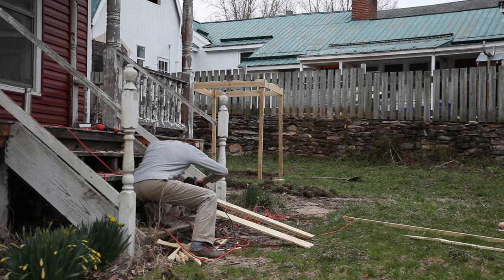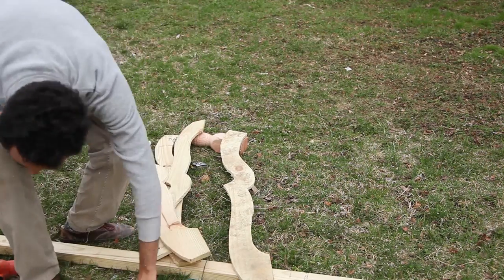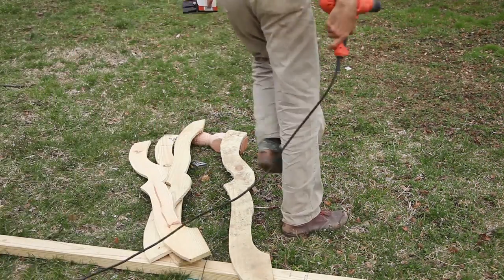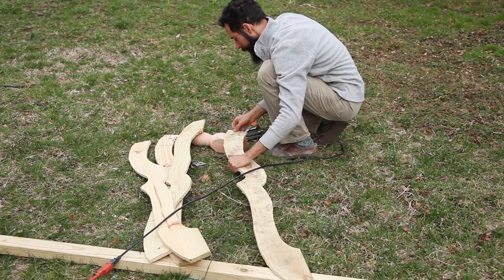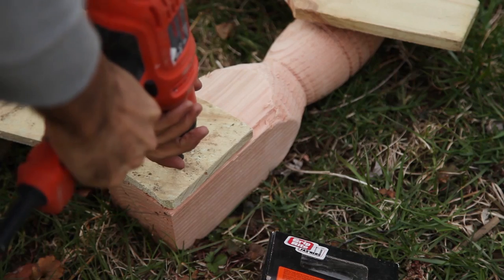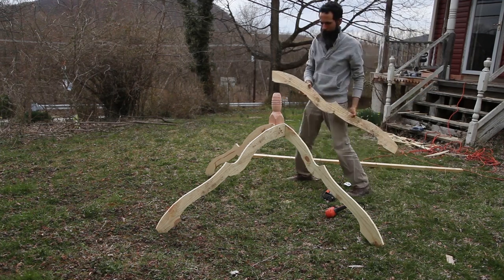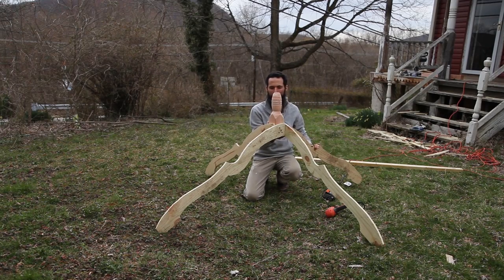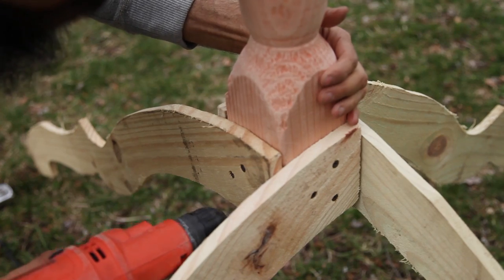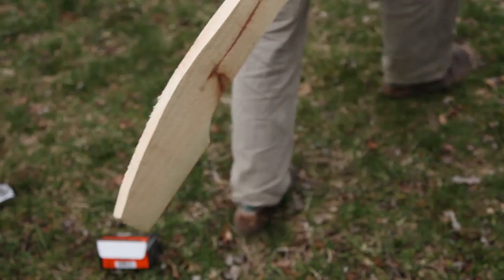Using a jigsaw, I cut the design out. While I was trying to make this an elegant design, I didn't want it to have too many unnecessary details and added-on decoration. Each piece had to serve a purpose, and these roof rafters not only would make the bed look nicer, they would also serve as cross-bracing reinforcement to make the structure more sound. And later on, they would become scaffolding to allow vining plants to climb — built-in plant supports.